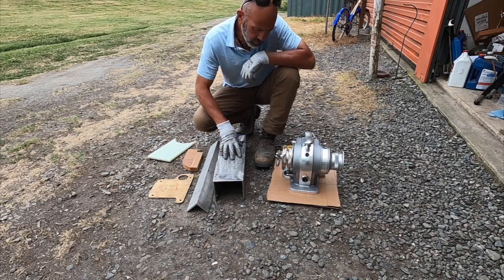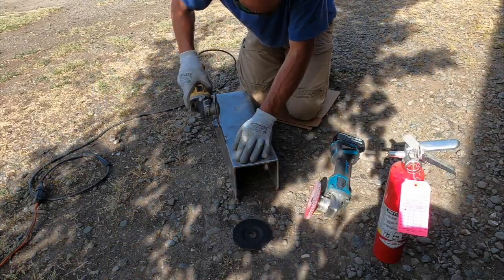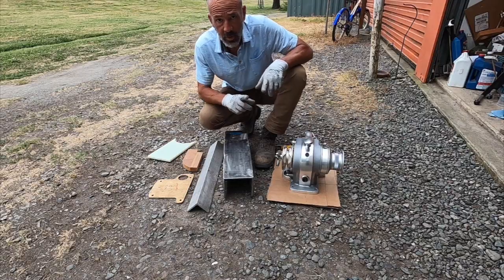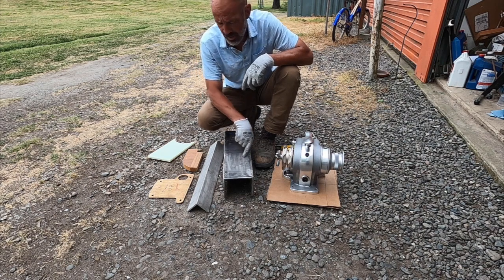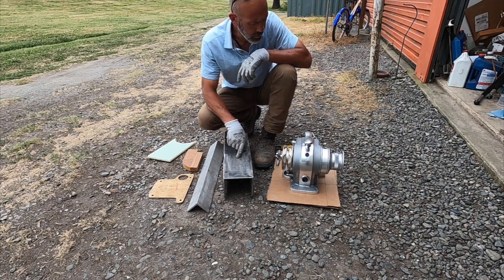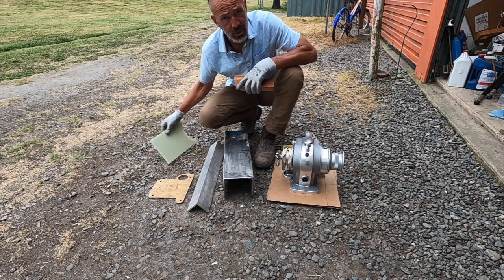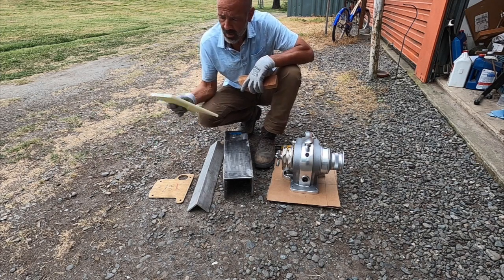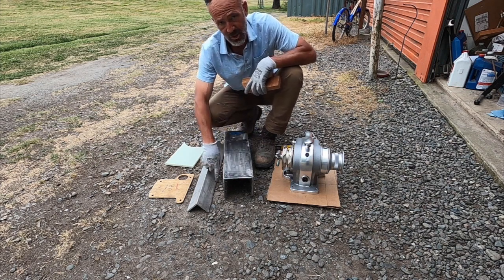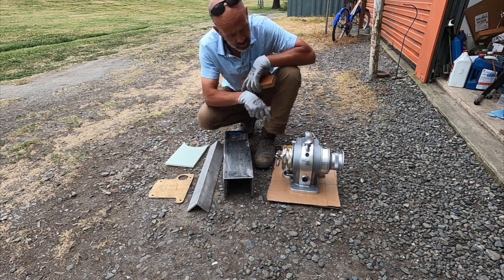So this is where I'm at with the bracket. I cut both the side flanges off — these were the old mounting studs for the old windlass. What I want to do is route the wires underneath the windlass so I don't have to drill a hole straight down through the bowsprit. I'm going to build it up on a one-inch riser block using half-inch plastic G10, laminate it, and have a hollow pass-through for the wire to wrap around and go through a deck penetration. Then I've got a Blue Seas cable clam for the deck penetration for the three wires that come from the motor.